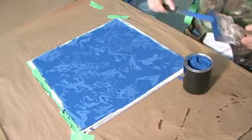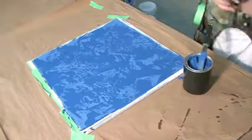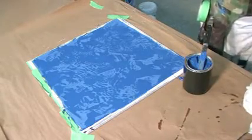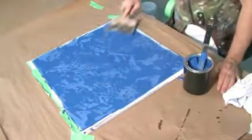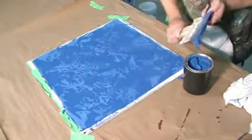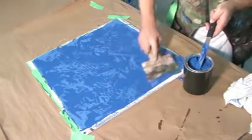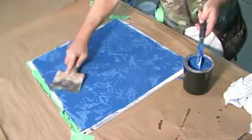When removing base coat, never place the trowel edge directly onto the surface, as this will leave linear lines, but rather place the trowel on the surface with a backstroke motion and move the trowel forward. While in motion, lift the trowel off the surface rather than just stopping on the surface, as this will create lines in the texture. A good visual reference is to imagine your trowel is a plane lifting off the runway. This is the correct removal motion.